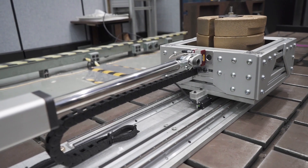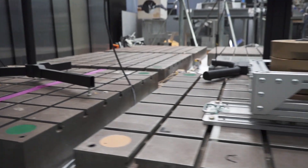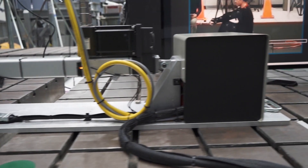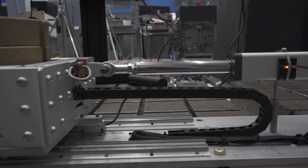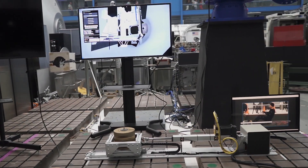We have a linear magnetic encoder that measures the position of the mass, allowing us to understand the workspace limitation as well as stabilization information. The ACTIVISS system is a single degree of freedom test bed that will be scaled to a full six degrees of freedom. The simulation is integrated with this single degree of freedom prototype so that it drives the hardware as if it were one leg of a larger VISS system.